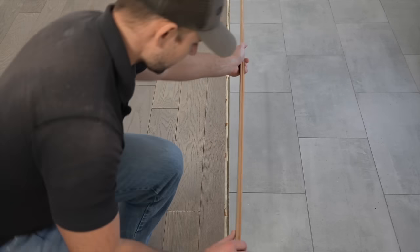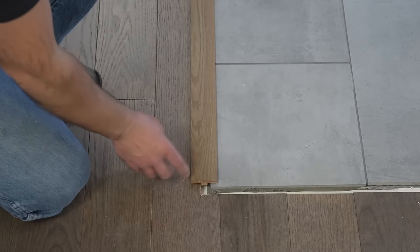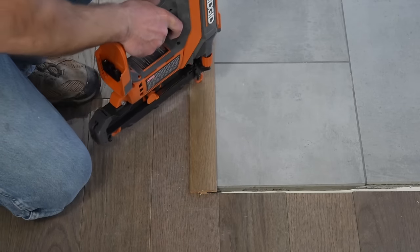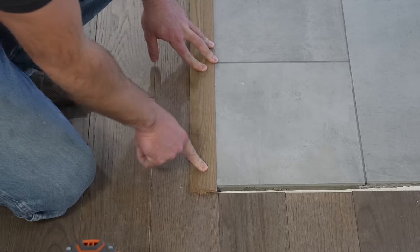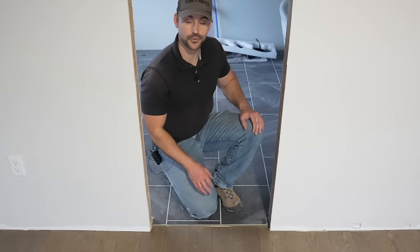To install the T-mold, all we've got to do is place it right in between the tile and the hardwood floor. When installing, cut a 45-degree angle on this piece and the intersecting piece, line them up, then take a finish nailer and shoot it down about every 12 inches or so. I like to put liquid nails on it so that when nailed down and the glue sets up it's extra secure. Don't forget — install your door first, then install the T-mold and cut around the jamb of the door. If you need to know how to install tile floor, I made a video installing this tile floor you see behind me — check out that video, it'll help you out.